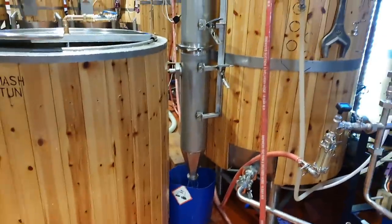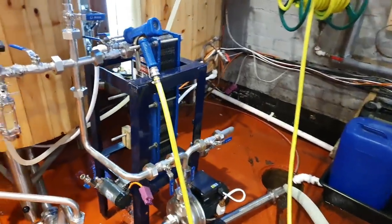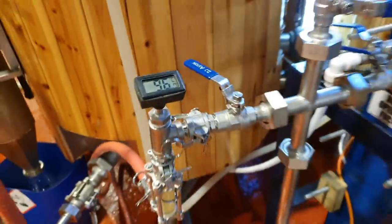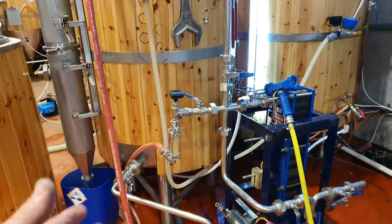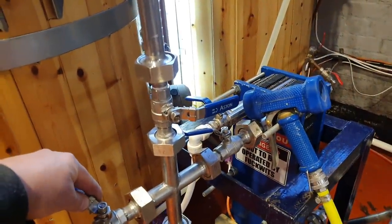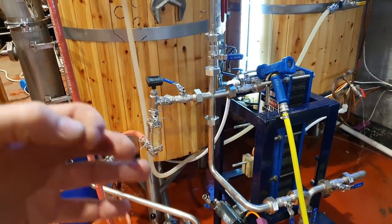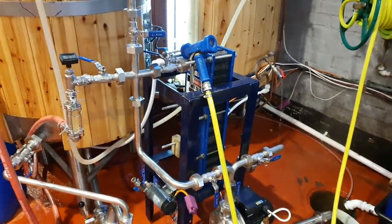So apart from that, it's been a grand old day. I've enjoyed it. At the moment I've got the wort running through the plate chiller — it's up at 96, 97 degrees C. Even though it's had an acid treatment and been cleaned and sanitised, I like to do this as well, because if there are any nasty bugs hiding in any areas that the chemical can't penetrate, the heat can — it will just conduct along the steel in the plate chiller and kill anything that shouldn't be there, unless it's a thermophile.